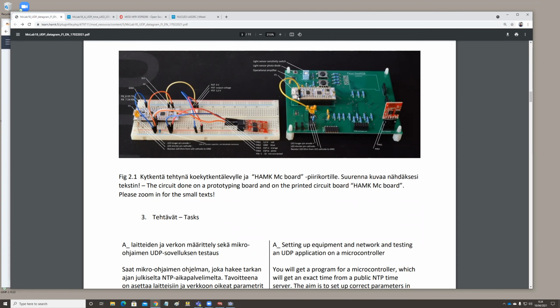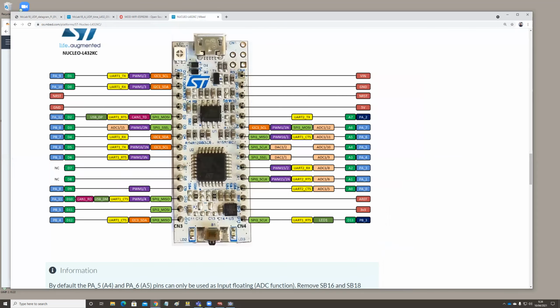directly on the pins, not in the pins 0 and 1 in here. And the pins 0 and 1, this is the D1, this is the D0. So remember 1, 0, although the other ones are all in the right order, D2, D3, D4, D5, and so on, but these are D1, D0.